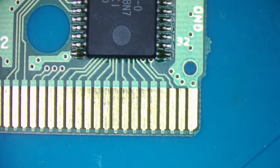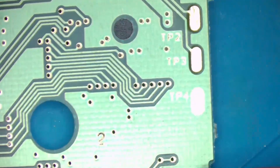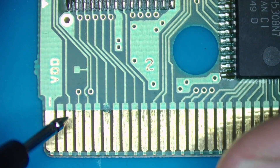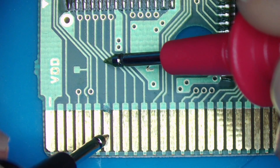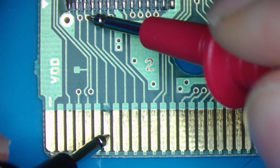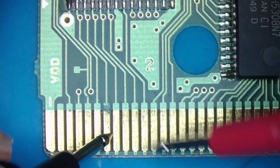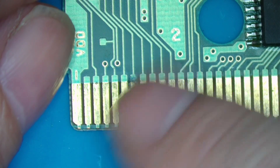The rest of them look okay. Nothing on the other side of the board. We'll check that pin and perhaps do a small trace repair. We'll go into continuity mode and follow this up to here - and there's no continuity. So I think it's just this here. I'll use a fiberglass pen and scrape that off and see what it's like underneath.